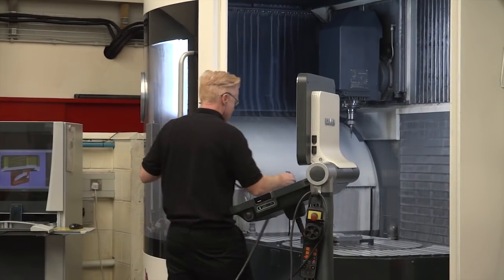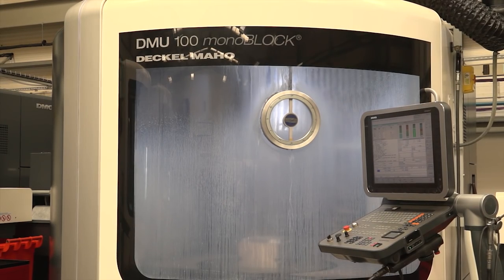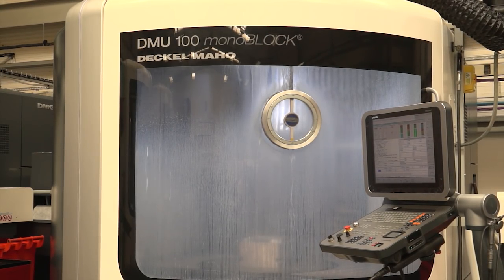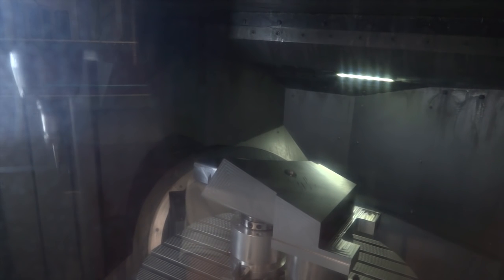You are a DMG user — why did you go for the monoblocks? It's obviously a heavy machine, it's a single piece polymer casting. We wanted two additional 5-axis to go with our bigger 5-axis. DMG machines have got quite a broad range. A typical mold and die 5-axis doesn't need extreme undercuts — it's generally around 25 degrees. So we went for this configuration, which is a B-axis head with a rotating table. It worked exactly how we wanted it to. And of course the bed with the Z-axis moves up and down — it's actually the bed rather than the head of the machine.